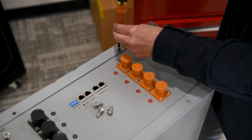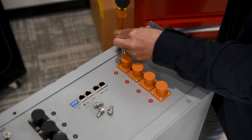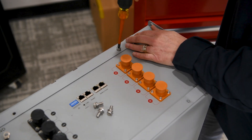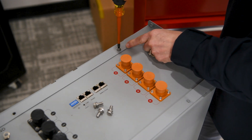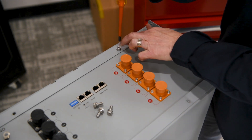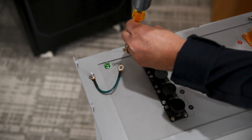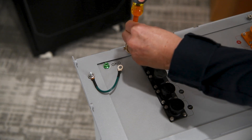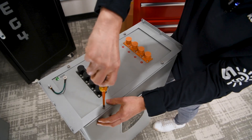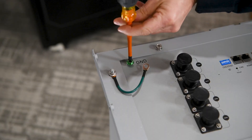One tip is that if we assemble the conduit box onto the battery, we don't have to apply these screws in after the box is built and worry about how long our screwdriver is to get in and attach it to the battery. It's so much easier to do while the top is not on because we have as much room as we need to work. Four screws and your base plate is secured, and we will now attach the grounding lug.